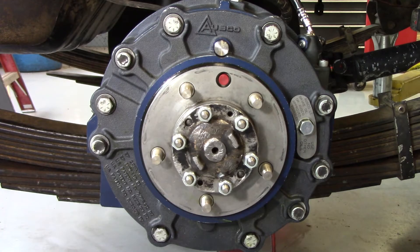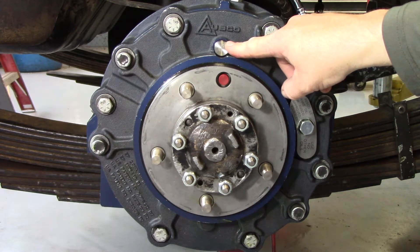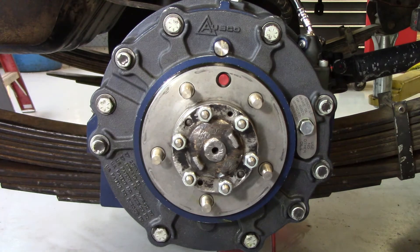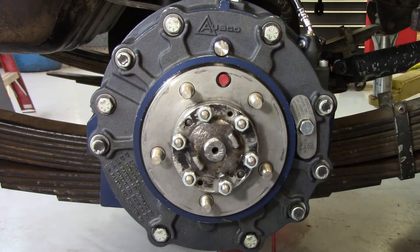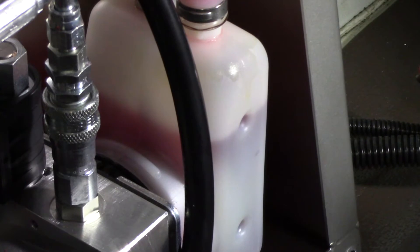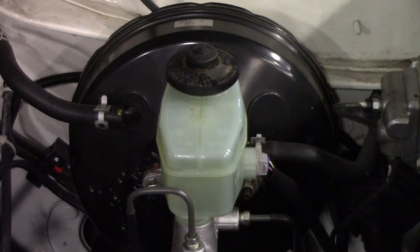The objectives of the minor routine service are: number one, to check and record the wear pin measurement on each brake; number two, to check the oil fluid level and oil condition and replenish if needed; number three, to re-grease the LC Brake Hub with non-EP grease; number four, to check the fluid level of the premium pump pack reservoir and top off if needed; and number five, to check the master cylinder reservoir's fluid level.